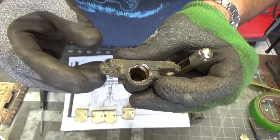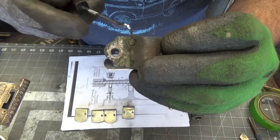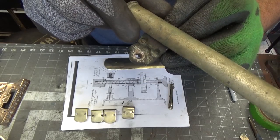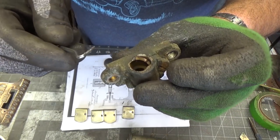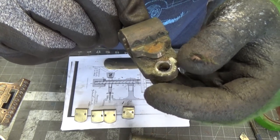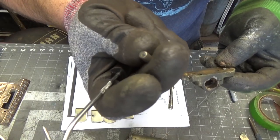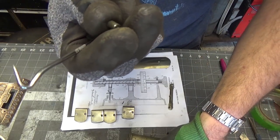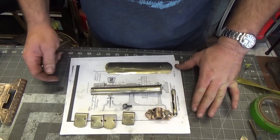This is the nut for the lead screw. It has this little detent — a relief that this spins over and engages at some point. I imagine this is some sort of backlash mitigation for this nut, and in addition there's also this pinch nut. Then there's a flathead screw and a little pin that goes right there — a through hole that takes this little pin and this little screw spring. That's all the pieces cleaned up.